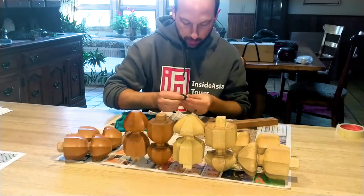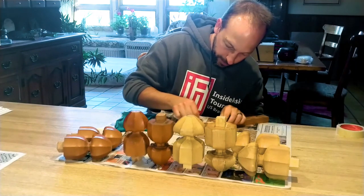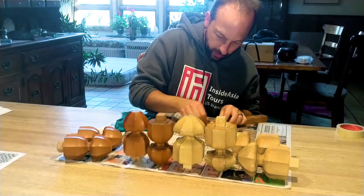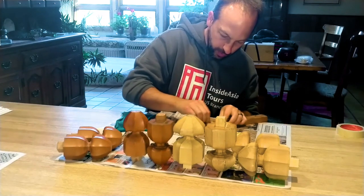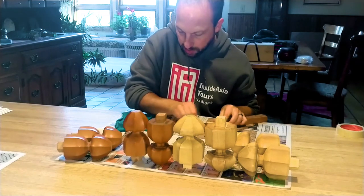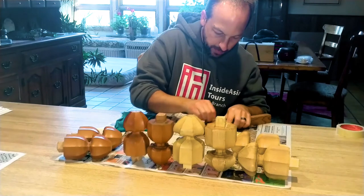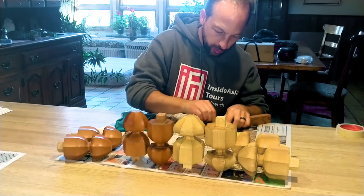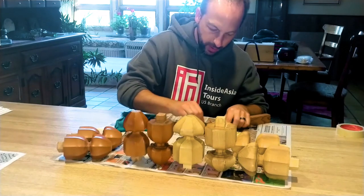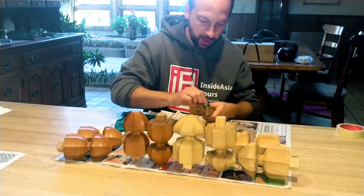The reason I like steel wool is that it does kind of rough up the grain just a bit. And so it does make the grain pop, especially when you're using it on raw, unfinished wood like this. Go ahead and swirl it all directions, not just with the grain, but also go across the grain. And it's really going to make that grain stand up.